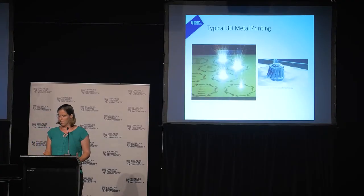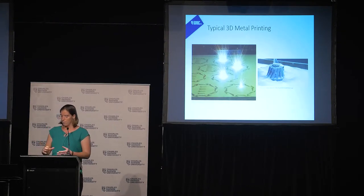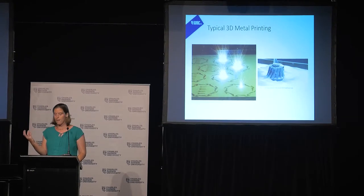Typical 3D metal printing uses technology where you put a powder layer down, you get a heat source, and you melt it layer by layer. In between each layer you have to wait for it to cool, then put another layer — so this makes it quite slow. It also uses expensive gases. In the end you remove all the powder and you get this part, but it has a lot of pores and it's not so strong, because in between each of those layers it can crumble.